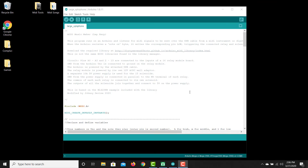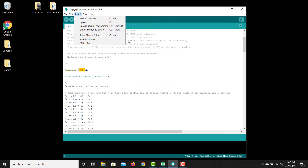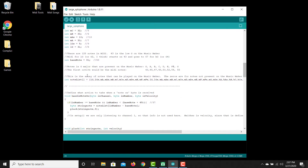The program running on both Arduinos is fairly similar and I have them in their entirety on my website, linked below the video. Both require installing the MIDI library, which isn't in Arduino's official library manager, but there's a link on my website to download it from GitHub. The program is fairly simple — I've defined all the different keys on the xylophone and the relay they connect to for reference. There's a note list with all the different notes that can be played, assigning a number that relates to the actual MIDI number sent from the digital audio workstation, starting at 31, which would be the low G.